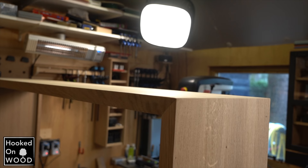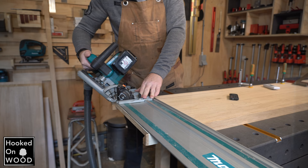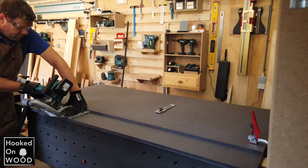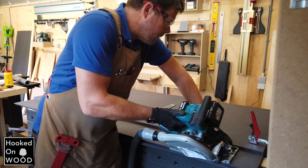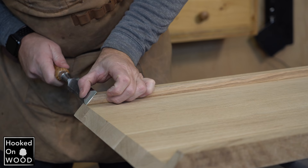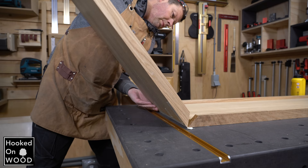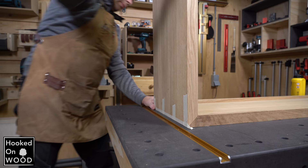If I have to cut sheets too big for my table saw and miter saw, I use my plunge saw. When I made the bevel cut for this desk, I used my plunge saw, because I can only cut a bevel on a piece of wood shorter than 130 cm with my table saw. Making this cut in MDF works fine, but making the cut in oak accurate to 45 degrees was not that easy — at least not with my Makita. This was 25 mm oak with thick sides, and I had to try multiple times before I was satisfied. On a table saw, a cut like this would be much easier and more accurate.